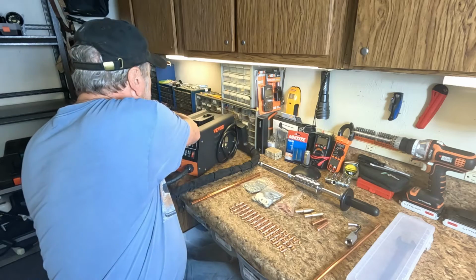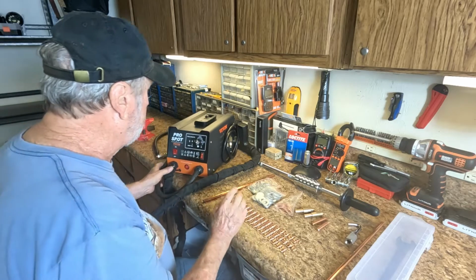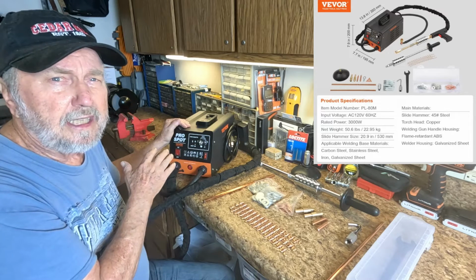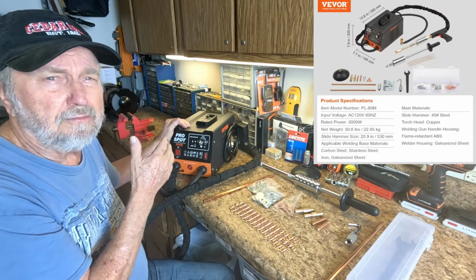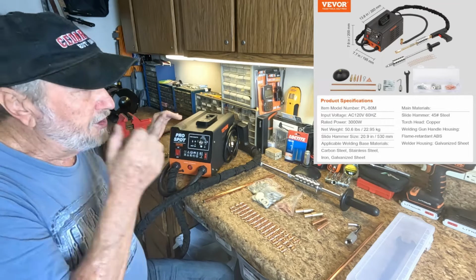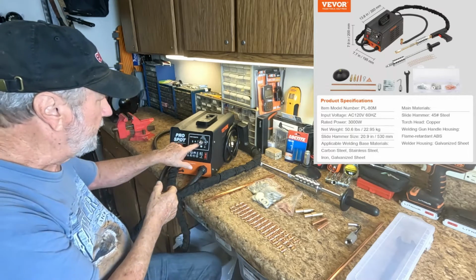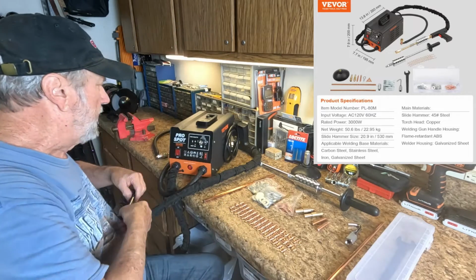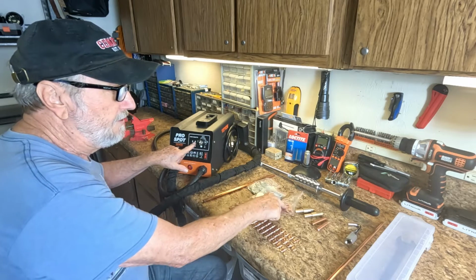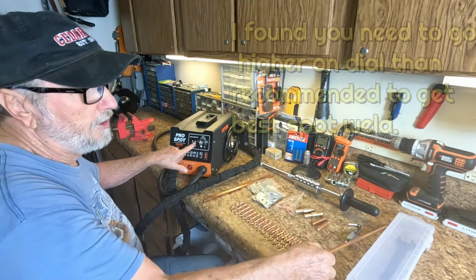And let's see here. We've got all the pieces explained, and now we are ready to look at the welder itself. There's just a few controls. It's already got the intelligence in there, so you don't have to deliver the amount of time of the pulse. It puts a control pulse out, just a second of high current to weld the thing. So you just set it here, and you have a control button right here, tool select. So the first thing you have to do is select the type of device that you're going to spot weld, whether it's this, or this, or using these.